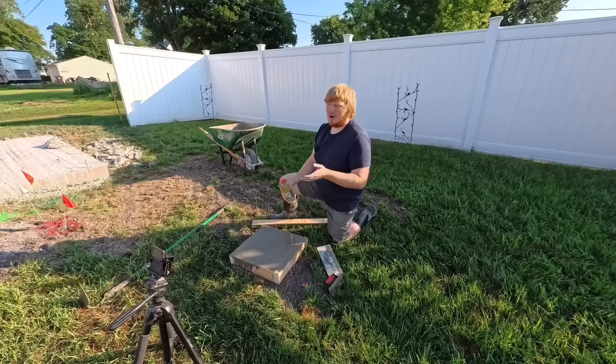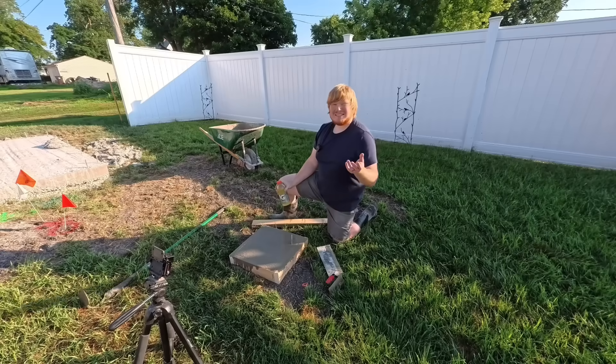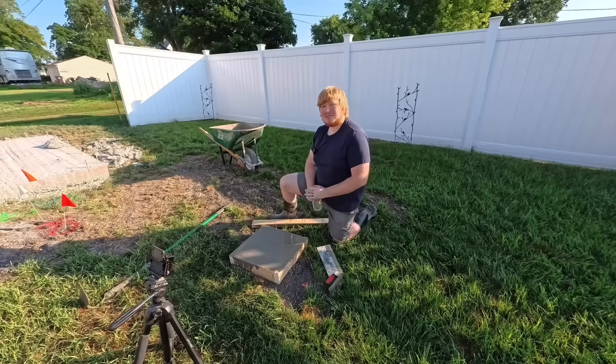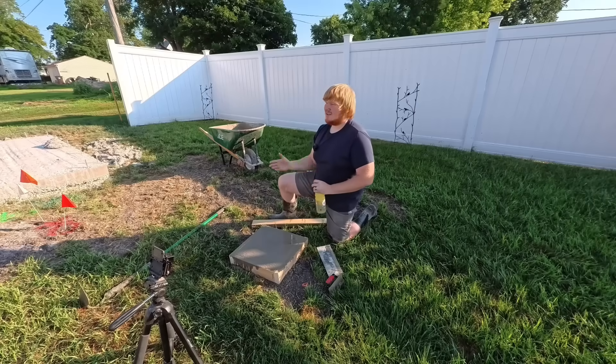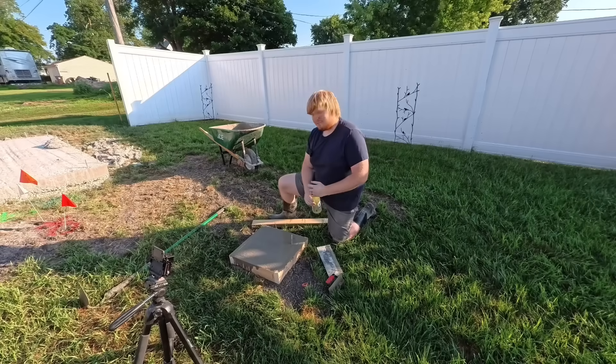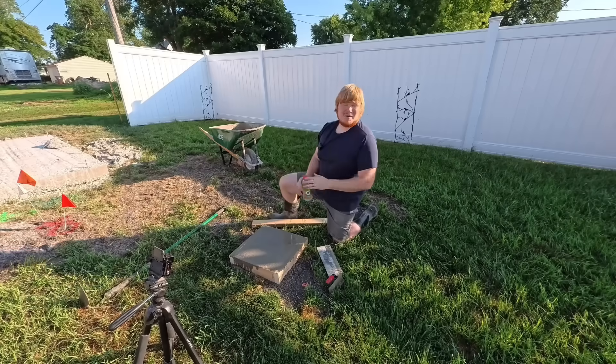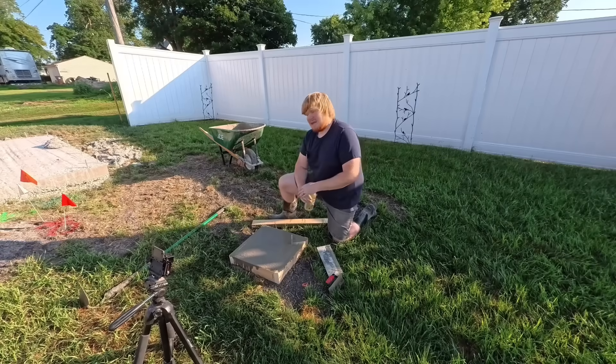You'll be able to confidently walk on top of your pad within two days after the pour — mine set up in about eight hours. Otherwise, it takes up to 28 days for your slab to fully cure and harden, so plan your build accordingly so that you're not stressing out the foundation you worked so hard to make. Thank you for watching. Check out Who's the Voss for free plans — not only for building garages but also for small woodworking projects.